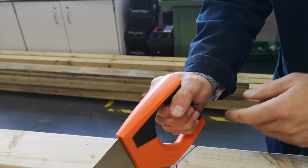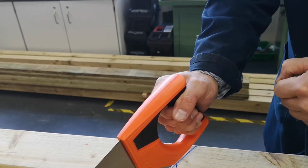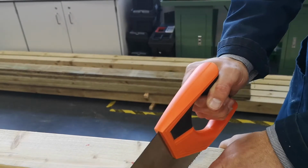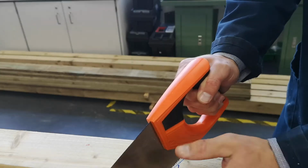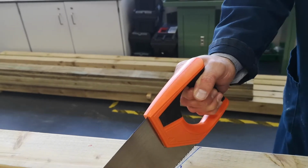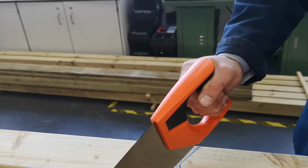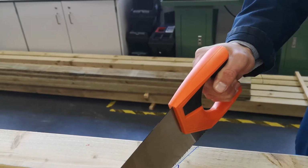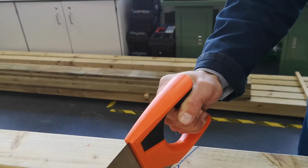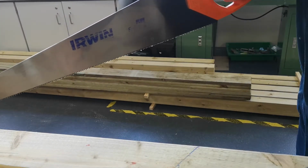So we're going to start off by the handle with the teeth of the saw, to start the cut. Make sure this freehand is well away, because I don't want you to end up slipping with the saw and cutting your finger. So safety first, keep this hand well away. You can move it as long as it's approximately the length of a 30cm ruler away from the saw. I'm going to gently use the weight of the saw, gently pull the saw back 1, 2, 3 times. You've now got a groove on the corner,